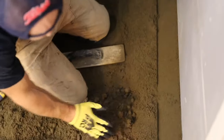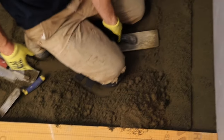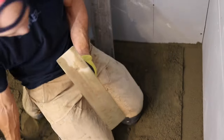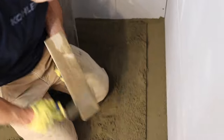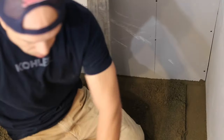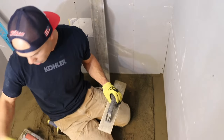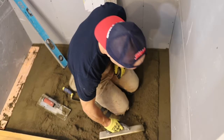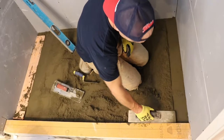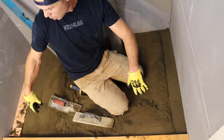I do love using 2-inch Kerdi-Board for my curbs. They make a really nice curb. We were running into issues in our area. You know, here I am saying Californians do it better. But one of the flaws we have is we have a lot of slab on grade foundation. So what the builders do to build curbs, they'll just put a pressure treated 2x4 down, glue it, and shoot it in with, what are those things called, Ronnie? With the 22 shells? Ram set. Shoot in with a ram set.